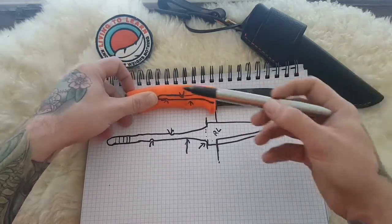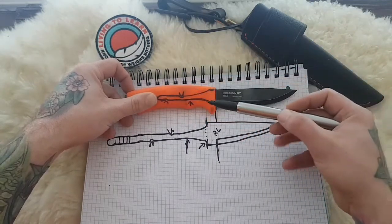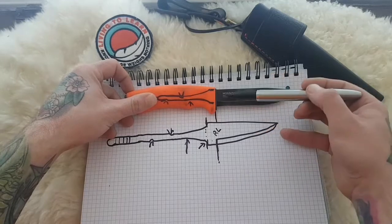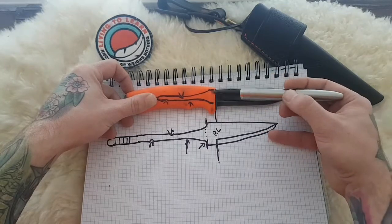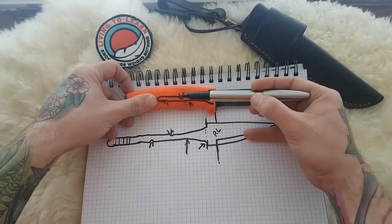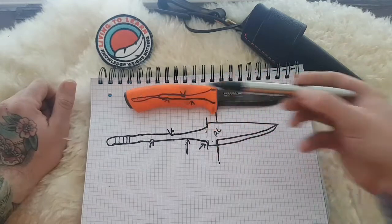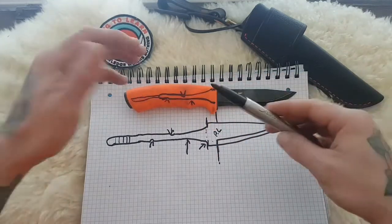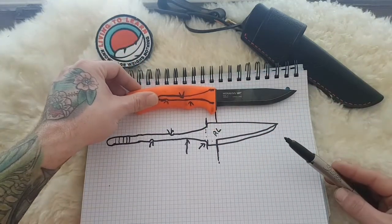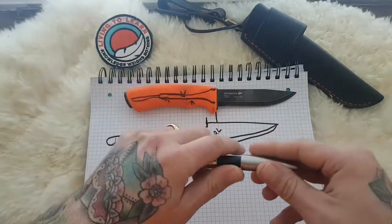And hopefully that answers the question of why they are there, because once you take all these engineering factors into account, moving the shoulders up above the plunge lines, moving the weak point, which is usually the neck, further down into the handle, and these recessed holes here which allow the blade to become a total part of the handle and stop the pressure of it flying back and forth out, you can see why they don't need this at the bottom. It uses less metal, it helps keep costs down, you're not sacrificing strength.